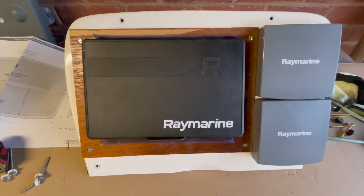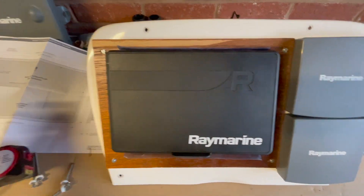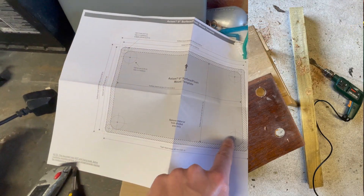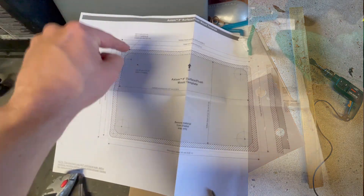No, it's not too bad really. Basically I've cut a couple of pieces of ply and fitted this in using the template. With the template I used the four corners - I put four dots in, got a 24mm drill, drilled the corners, joined the corners up and cut that out.